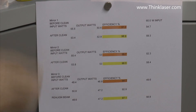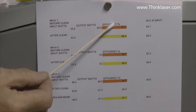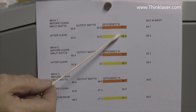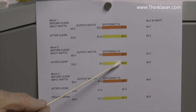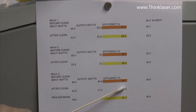My suspicion is that if I could raise that beam very slightly I would get more efficiency. I'm going to tip the beam up very slightly and give it a quick pulse. You can see it was low - now if anything it's slightly high - and there we go, spot on the centre. So we've done a summary of the results: mirror one went from 91.2% to 98.9%, mirror two from 95.7% to 98.5%, and mirror three started at 94.7% - cleaning made it worse until we realigned it, then we took it up to 97.1%.